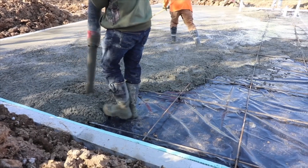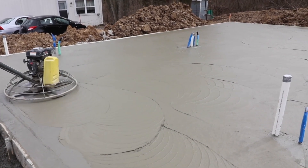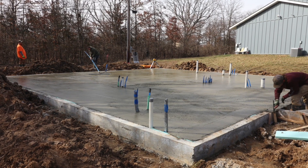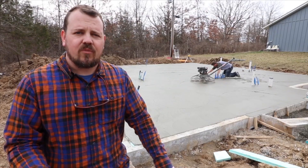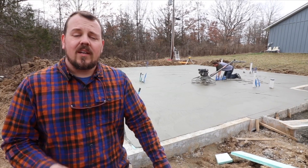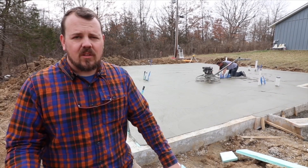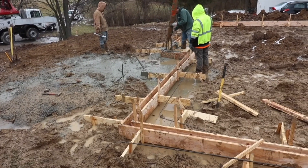The difficulty with that is when you have that concrete slab come over, turn down, and tie to the ground, that concrete will be exposed due to code — there's six inches of exposed concrete before you get to soil. That means our slab that you're going to walk on or live on is thermally coupled to the outside. If we look at one of the neighboring houses here, I can see concrete that's less than eight inches from where you're going to put your foot, and four weeks ago we experienced negative nine temperatures here in Missouri. There is absolutely no way that concrete floor is comfortable at negative nine degrees. One of the goals of building houses is control of our environment — that separation between outside and inside. That's why we put insulation in the walls, but for some reason our market and most markets in the United States build an uninsulated turn-down slab assembly.